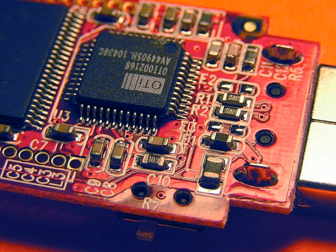Topic: Hot gas. During hot gas soldering, the energy for heating up the solder joint is transmitted by a hot gas. This can be air or inert gas, nitrogen. Advantages: simulating reflow oven atmosphere. Some systems allow switching between hot air and nitrogen. Standard and component-specific nozzles allow high reliability and faster processing.